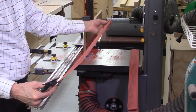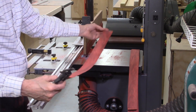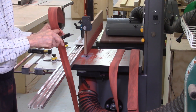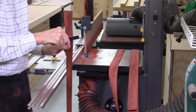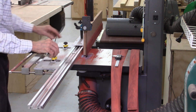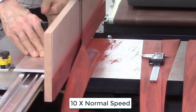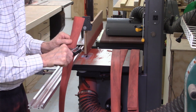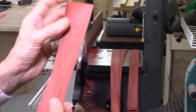The AccuSlice system is very accurate cutting a board five thousandths of an inch over 36 inches of length and two inches of width. A second board measures around six thousandths of an inch. Can I go even thinner? Let's try four thousandths — instead of turning the wheel five thousandths, I'll turn it four. This measures right around four and a half thousandths of an inch, and that's pretty much the limit of the system — the wood is actually splitting at that point.